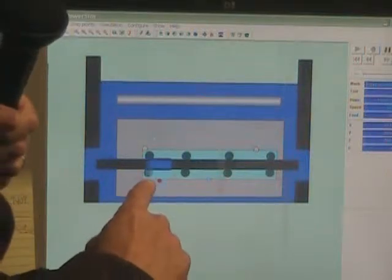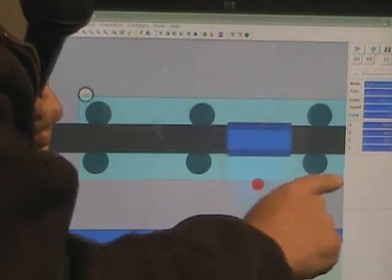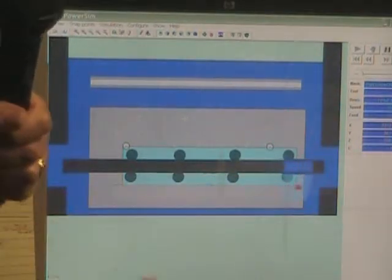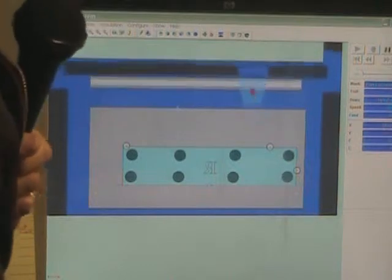The computer is going to put an edge on that face down there. That red ball going across there is placing an edge on the front face of the granite, because there's only one finished piece to this. It's unfinished on the back and on the sides, and then the front gets an edge. And it takes, what, four cuts? Four passes, yeah. Four passes to make the cut.